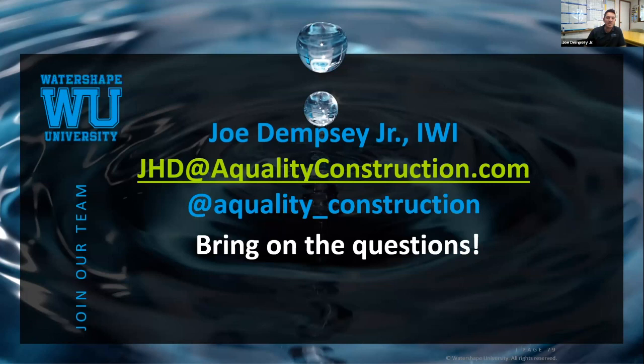Post-construction, he's asking. Yeah, so we do have less than a 30 inch drop to the landscaping around the pool. And right now we have a temporary grate system in the catch basin, which is the only place that has more than a 30 inch drop. Once the landscaping gets a bit further, that temporary grating system is going to be raised up higher and filled in with a Mexican beach pebble, I believe, which is going to have less than that 30 inches of drop. The look from down the hillside makes it seem like the edge of the hill is closer to the pool, but it actually comes out about 5 feet and then steps down with boulders and things.